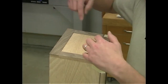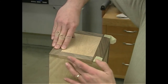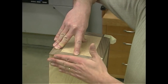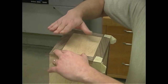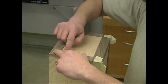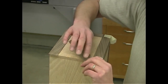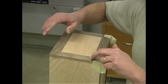I've gone through and cut the four pieces of banding I'm going to use on the end. I want to get these to fit up real nice where the joints are, and I do want them to overhang a little bit on the edges — we can always sand that up flush. By leaving it overhang about a 64th of an inch, we can be assured of no gaps where the other piece comes up against it. Once I get these fit up well, I'll mask off the inside area because we're going to get glue squeeze-out, and by masking that area off we don't have to deal with it after it becomes a problem. A tip: if you're going to be buying veneer, you may want to buy adhesive-backed veneer — a heat-sensitive veneer — so you can just iron it on and move on.